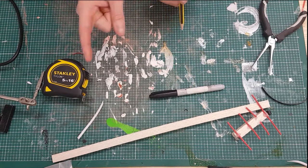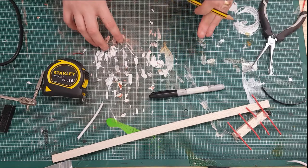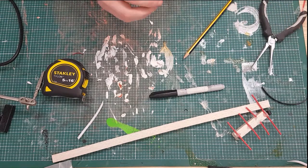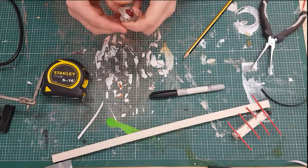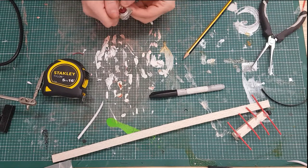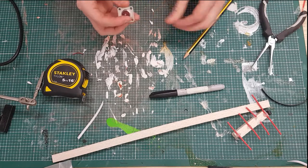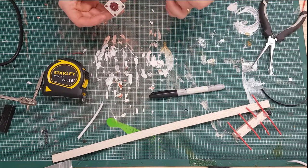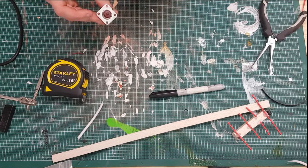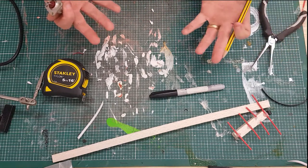I have also now since found out that there can be an issue when mixing the metals, not necessarily with transmit, it'll still transmit okay, but more with corrosion, galvanic corrosion. Whenever copper and aluminium are together for any length of time, it will start to corrode at a slightly more accelerated rate. The fact that I'm mixing the antenna element and the radials coming off the side isn't actually an issue. What is an issue is this base plate itself, because I am pretty sure this is probably aluminium and the copper is in direct contact with it. So you will then have these parts here starting to corrode.